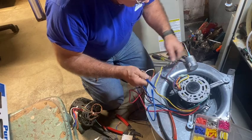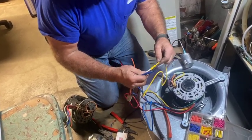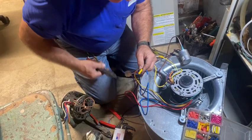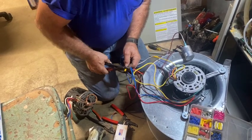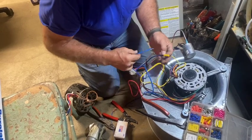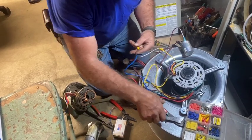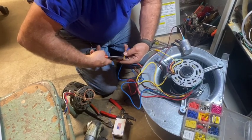When you make these wire connections, you want to double-check them and give them a little bit of a jerk. You don't have to pull like crazy because you will pull them out, but you want to make sure they're secure. Once they're zip-tied in position there'll be no pressure on them, but you still want a nice, secure connection because the job of that connection is to pass electrons from one wire to the other. If you increase the resistance, you increase the amps and will cause a failure — it'll actually smoke that wire.